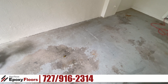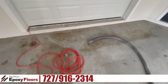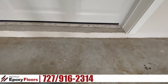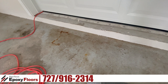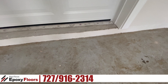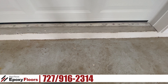There are a couple of things going on here that are a little bit different than normal. So back here there's a secondary garage, and what we're going to do is drop this down as much as we can — that's practical. We're going to do baseboards up until this spot, but we're going to double coat polyaspartic over the concrete to protect the concrete itself.